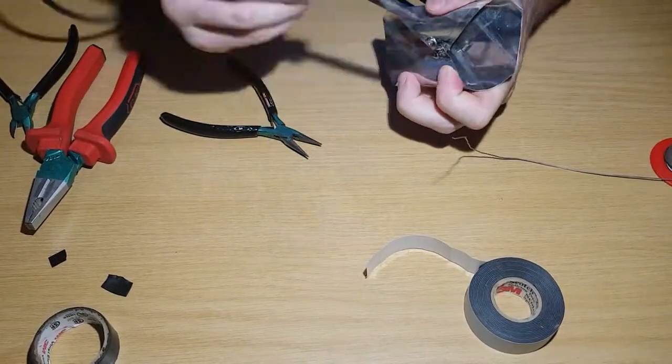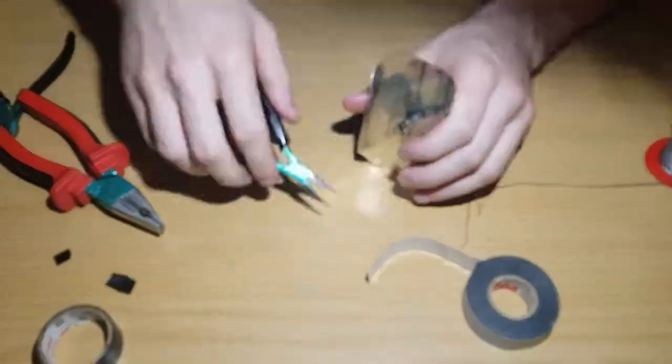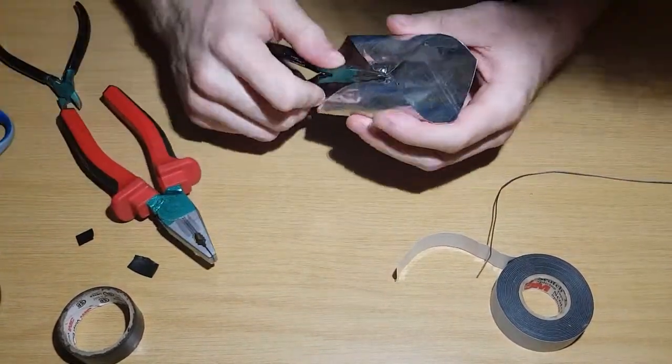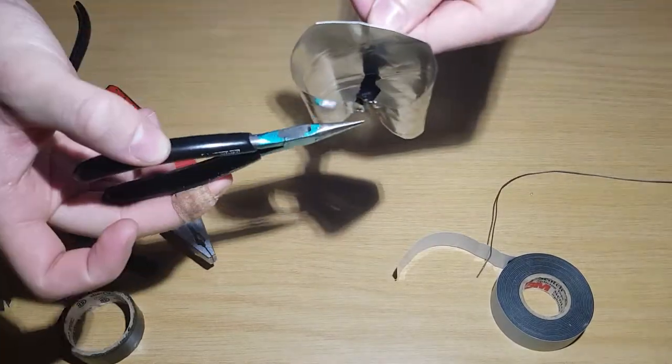The antenna is then shaped using pliers. It is important to note that the leaves must not short, and the ground must not be touching the self-grounding plane. And that's how you build a self-grounded bowtie antenna. Now if you wish to test this antenna, as in my case, I needed to get a special adapter to attach to a wifi router. The simplest way to actually test this is to use a cell phone app that can register the strength of the wifi signal that you can receive from that router.